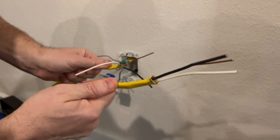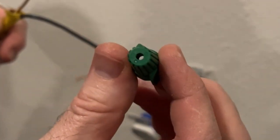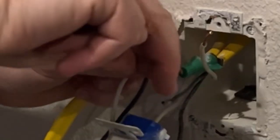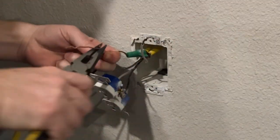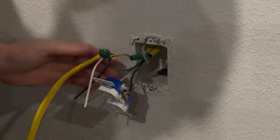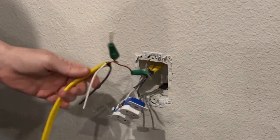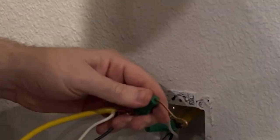We've got our power wire stripped back and black and whites are exposed with the ground wire connector. Now you have a hole up top because we're going to bind two ground wires together. We'll take the ground wire and just extend from the original one they have here. We'll make it nice and tight so everything stays grounded — they're specially made so it keeps it together and doesn't loosen up. Let's get the ground connected using needle nose pliers.